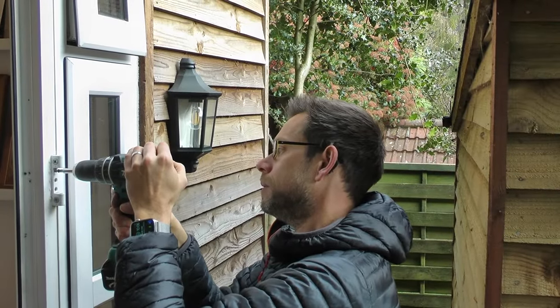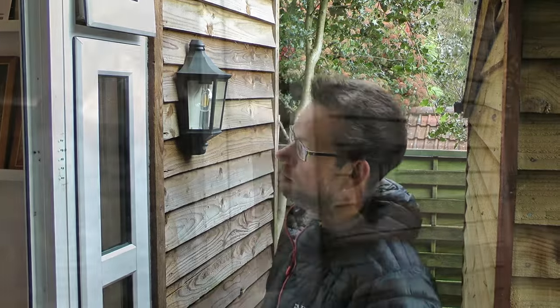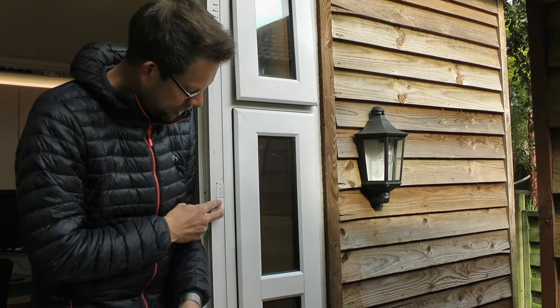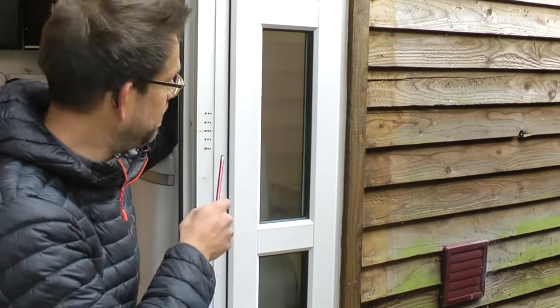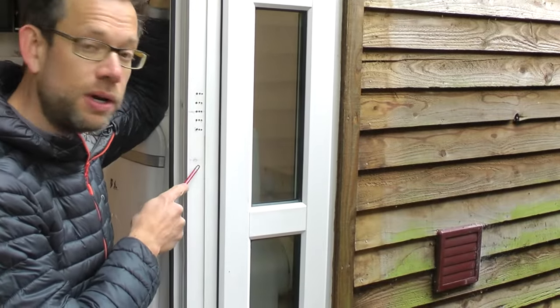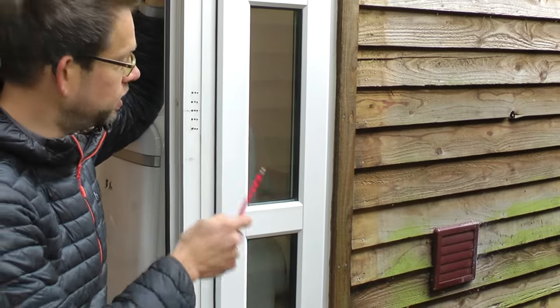Using the drill - there are quite a few screws - with a little bit of hammer encouragement. What I've done now is measured the middle point between the top and bottom hinge markers, taken a packer that came with the new hinge pack and made a template that gives me a line I can line up with that center marker. I've measured halfway along that packer and can now mark where the holes are going to go. My door frame is in terrible condition - the old hinges had been adjusted several times before my ownership. I've taken that original middle point and measured exactly 10 centimeters down on the bottom two hinges and 10 centimeters up on the top two hinges from that center point to give me a new mounting location away from all the old closely-positioned screw holes.